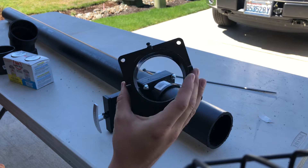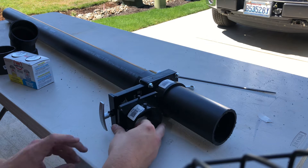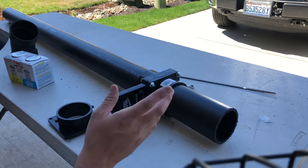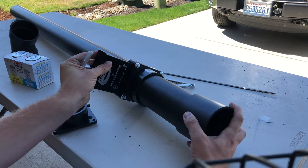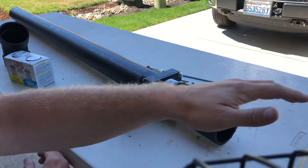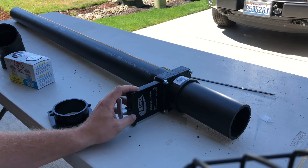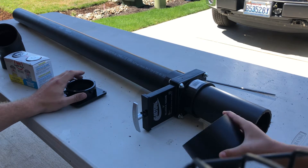This one here is a T1009 and it goes on the end of this fitting — you would hook your waste sewer hose right up to it. We're going to take this union out to the RV, put it on this side, and tie it into the system. We also have an elbow right here. Most of these parts you can buy at your local hardware store; the Valterra valve you may not find there, but I'll post links below for all the parts you would need.